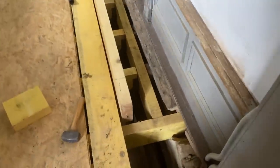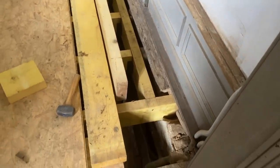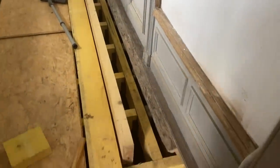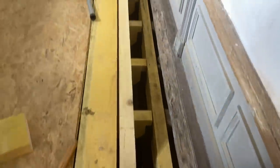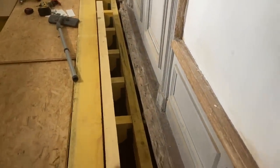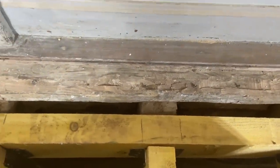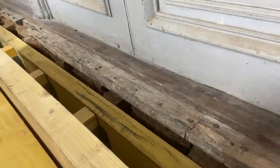Just a brief update on the floor. A few people have been sending comments — I changed my mind on the sister joists across. I actually decided to get two good joists in: one right through and then one at the far end. With the hangers, I can literally run a joist all the way across. I've also trimmed all the decent joists — the solid original oaks — and got them all level, all the way along. I can actually even screw this beam into the original joists all the way along, as well as the fact that they're suspended either end with hangers.